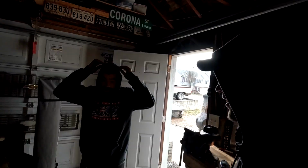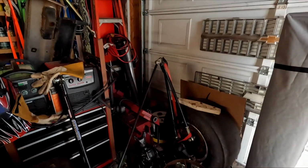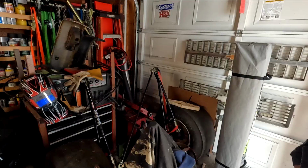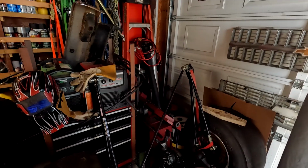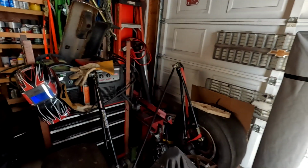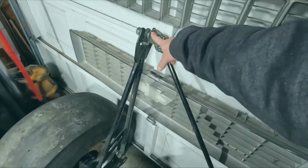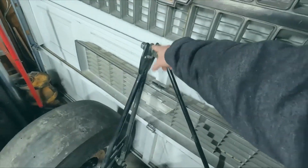Welcome back. Oh, it's wrong. It's got me messed up, man. I don't like it. The wishbone's gonna fix it. Yeah, but it ain't fixing it the way it should. Why? Because it ain't supposed to be on the outside of the front. This track bar was in the wrong spot, so we moved it back to the right spot. We just took this bracket and drilled it out to fit that bolt.